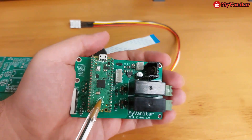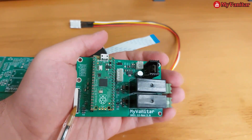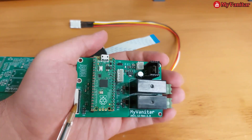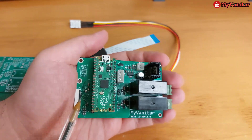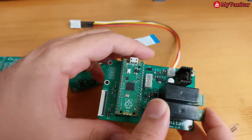This is the famous Raspberry Pi Pico board. The microcontroller is the RP2040 and the flash memory of this board is 2 megabytes by default. This is the 40-pin FPC connector — be careful with soldering this component. If you don't have experience, practice on a few before you work on your board, because it is essentially micro-soldering.